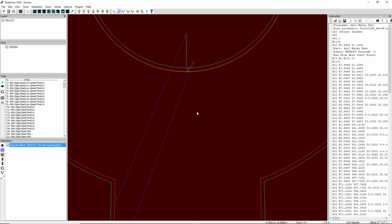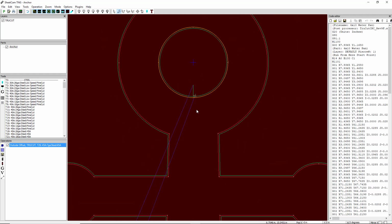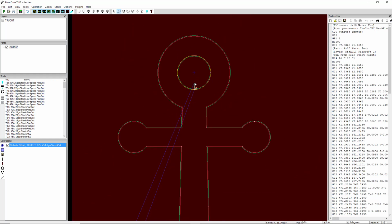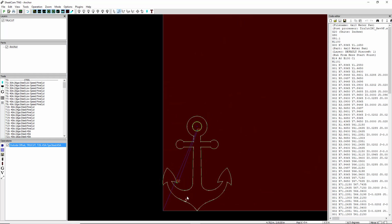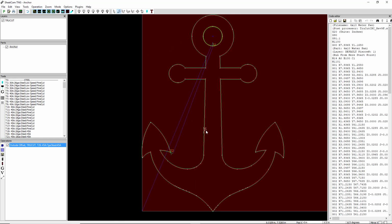And that's a good lead for any hole. Pretty much, that's going to be the lead you'll use for any hole. The lead length will vary. On small holes, you want the lead to be starting roughly in the middle of the hole. Larger holes, it doesn't really matter. So that looks pretty good right there.